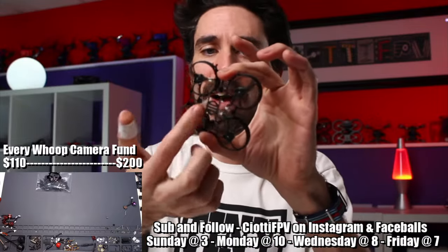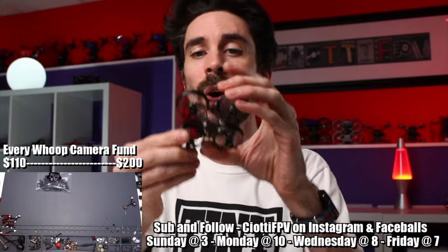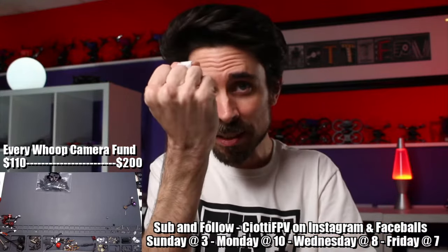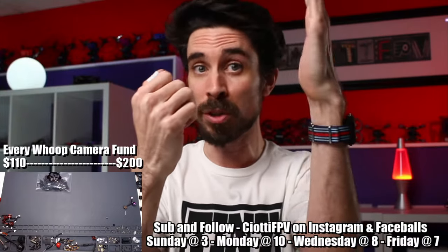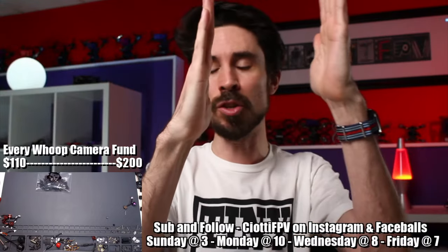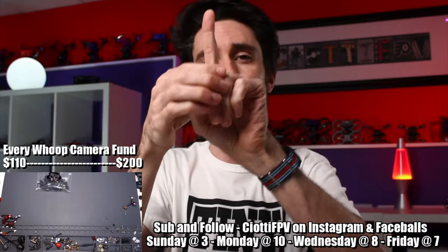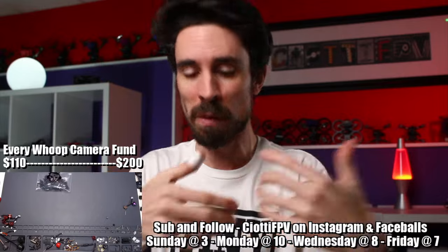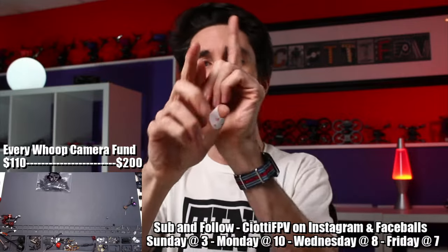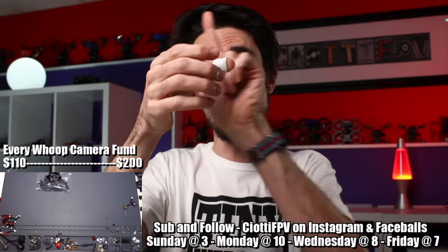If you put the carbon fiber brace on here, or if you run any of the carbon fiber frames that are out there, what happens is you've now solidly mounted that motor. So every single time you crash, that energy gets pushed into the propeller, and then it just dumps all that energy into the motor, into the can of the motor and the bell and the motor shaft. And what happens pretty quickly with a rigidly mounted motor is this tiny little 1 millimeter motor shaft will just bend up above the bell.